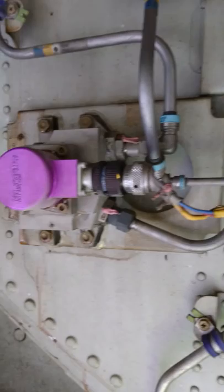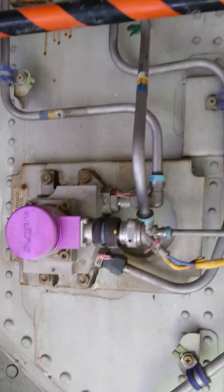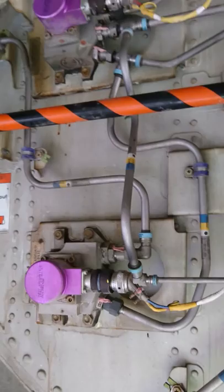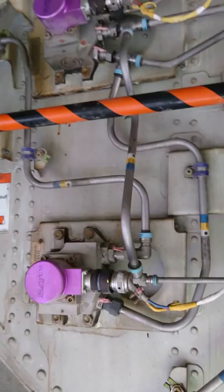As you can see here, this is the wire that connects the anti-skid valve to the anti-skid computer. So to recap, the main components of the anti-skid system are the anti-skid valve which supplies hydraulic pressure to the brake unit, the tachometers inside the wheels, and the anti-skid computer. These components must be properly connected in order to have efficient braking from the anti-skid system.